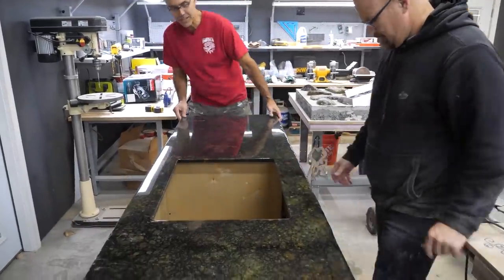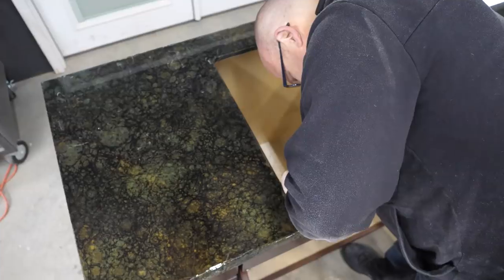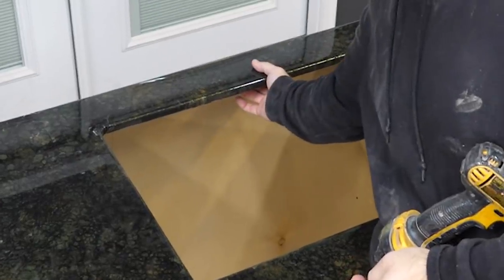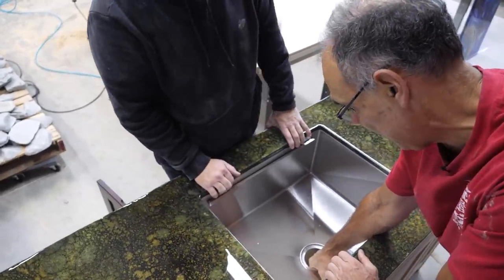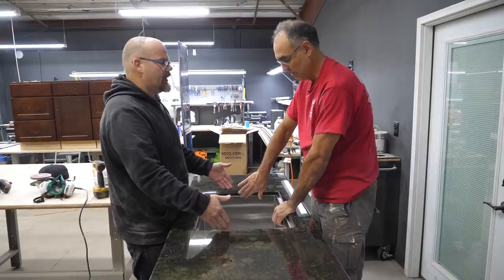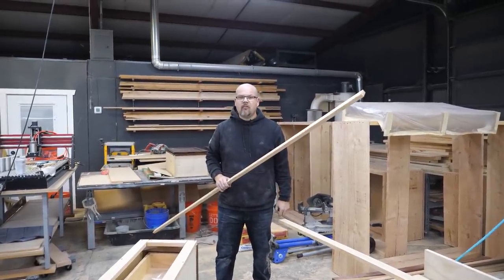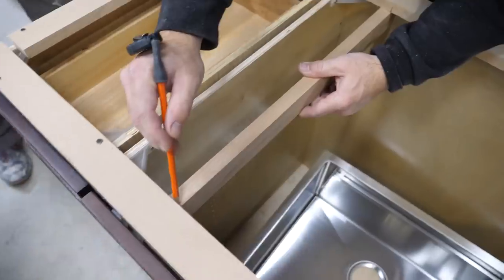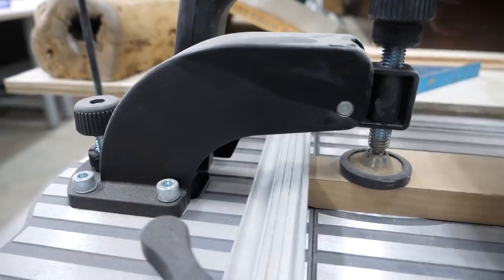Look at that gap — you don't want to pull drawers out and have no room there. So what I'm doing now is using my screws underneath into that screw strip we put on, and then it's going into the countertop. This holds everything down, makes it super secure, and makes your install fast. It fits perfect. I'll measure from that cabinet to here and that'll tell me where to put in my brackets. I'm going to make some brackets to hold the sink in place — just grabbed some hardwood and I'll use my pocket jig. This will tie into the front and back of the cabinet. I don't just glue it in with silicone because over time that silicone is going to want to become loose. Use a bracket — it'll hold that silicone gasket in place, you won't have leaks, and you'll have a professional install.